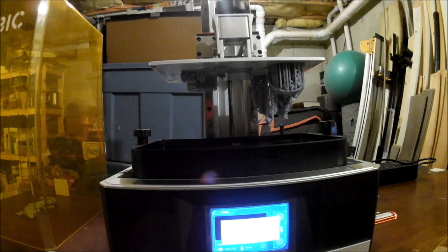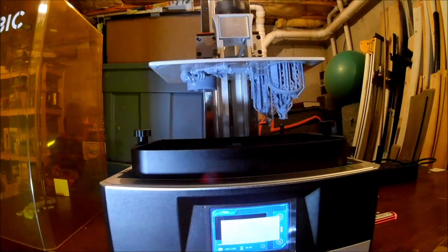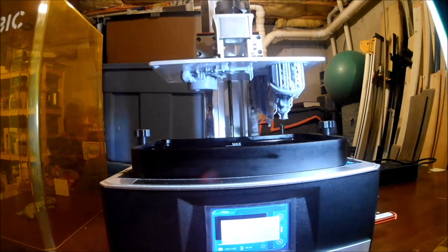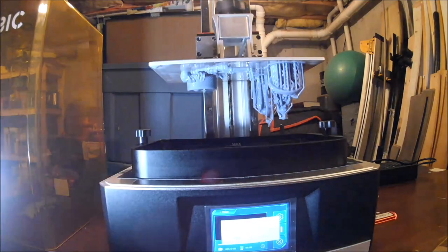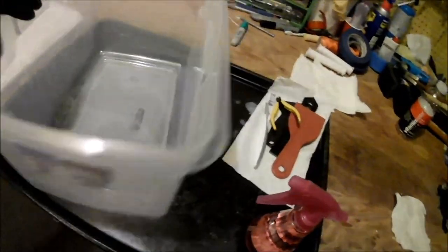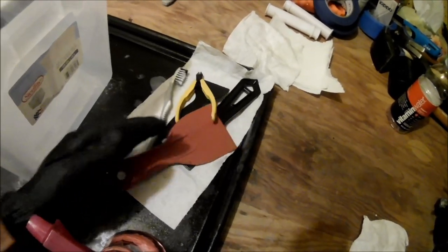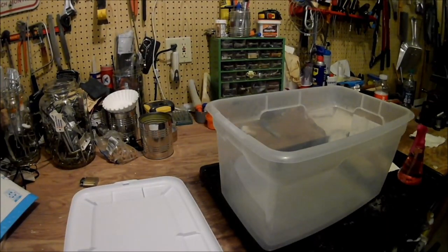The resin print time here was four hours ten minutes. Our first set of four models is complete — let me throw a little light under there so you can admire it. Everything we intended to print printed without any kind of catastrophe, which is not always the case. Now I'm going to pop these off, clean them up, and we'll see how they do. I've got my cleaning tools prepared — a bin to wash the parts out, scrapers, toothbrush, clippers, various parts to help get the part off the build plate. I have 99.9% isopropyl alcohol, some rags. I've also prepared my curing cabinet that's already rotating — I close it up, hit the UV light, and I'm ready to go.